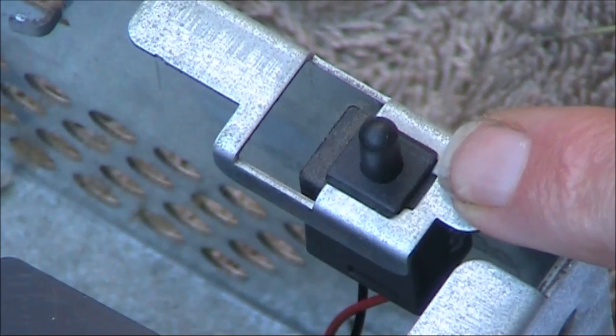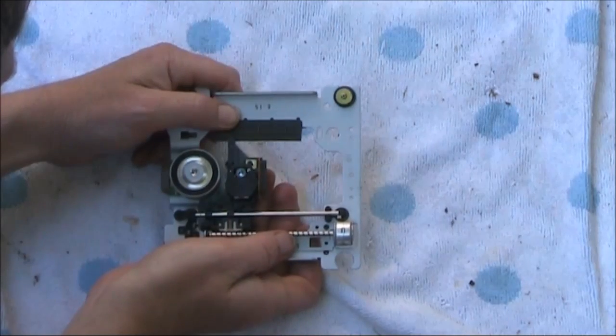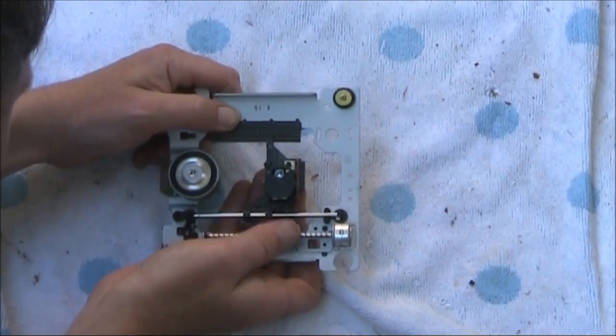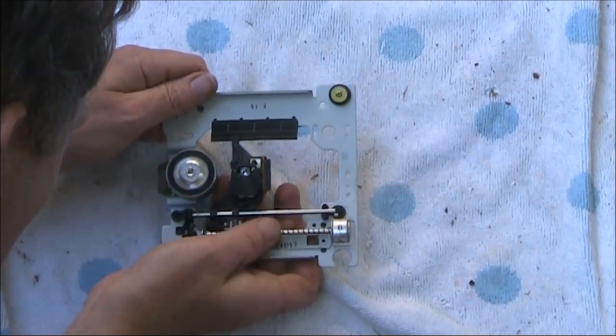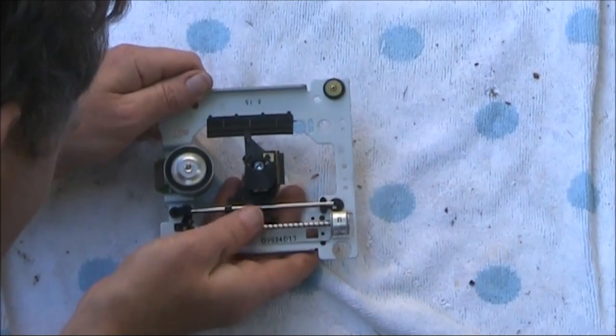There's a handy little switch here — presumably an interlock switch so the computer won't operate with the lid off. Here's another gem: a 4 MHz ceramic resonator found in this floppy disk drive. If you're in North America, a ceramic resonator like this can be put into a VXO circuit and pulled down to maybe 3.9 MHz, allowing coverage of the top end of the 80m band — useful for a homebrew AM, double sideband, or phasing SSB transmitter. This mechanism from a disc drive is also reminiscent of a slide rule dial and may form the basis of a permeability-tuned VFO. Put a sliding ferrite and coil former in here, and as you move the ferrite towards the coil, the frequency changes. Coupling the tuning knob to the thread near my thumb might provide some vernier tuning action.